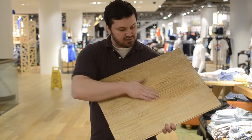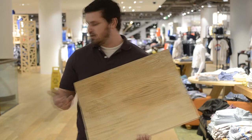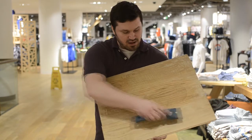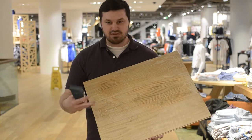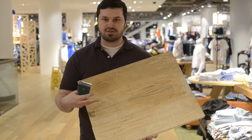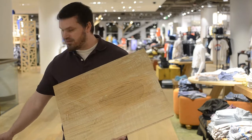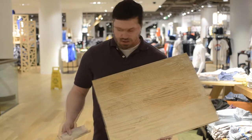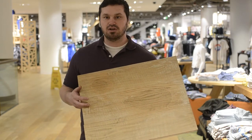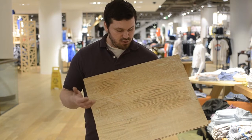Once we add that, instead of sanding it down, which I found takes a while and clumps up the sandpaper, we go back to our Stanley scraper and scrape back on the wood. That keeps the deep lime down in the tooling marks and takes off just the top coat. Then you usually do a final sand with sandpaper, and from there we take our refresh oil, depending on if you got the 5% white oil or the regular refresh oil. We're going to oil that in.